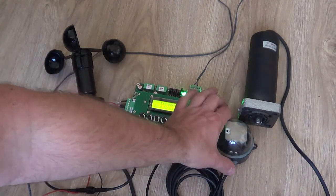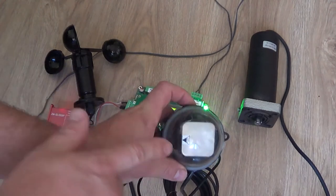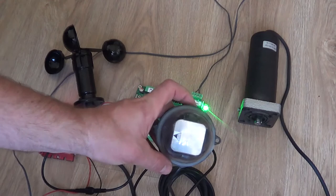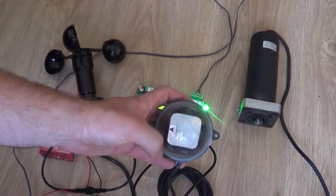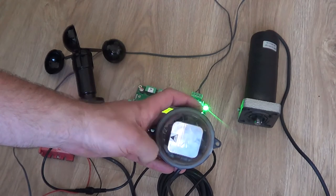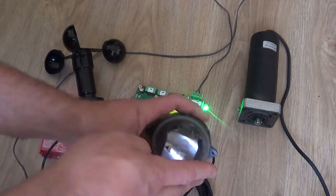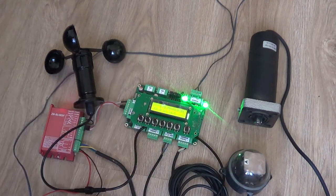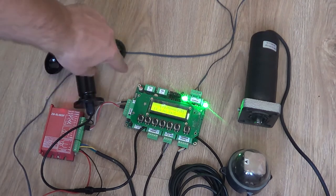The light sensor is very important to put it flat with the panel and have an east on the left side if you're standing opposite to the tracker. If it's gonna be in different way, imagine that you are just switching a little bit or just moving a little bit, then you will lose the correct readings and this driver will not be able to manage the correct position of the tracker. In that version we are not using the DC channel